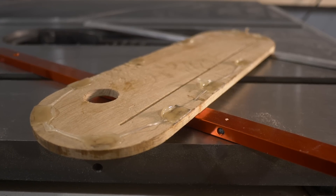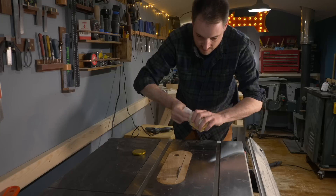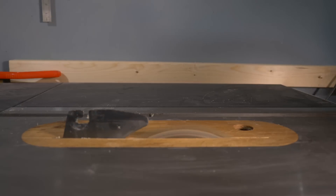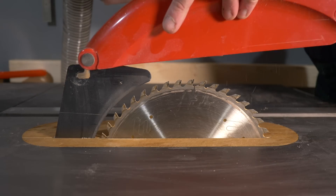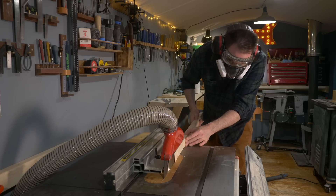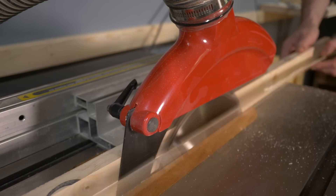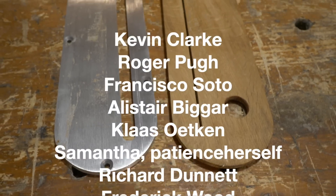It's not very pretty, but it means it's perfectly level. As I had the wax out, I used that to finish the insert and it should help pieces glide nicely over it. That's it all done — now I can make some thin rips without the pieces getting sucked down into the body of the saw. And when I need to tilt the blade, I just need to swap back to the old insert. This is definitely going to make life easier and make the operation of the saw a bit safer. Thanks for watching, thanks to my Patreons, and please subscribe for more videos.